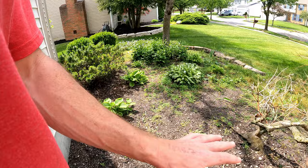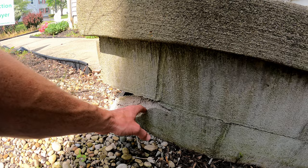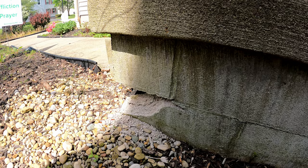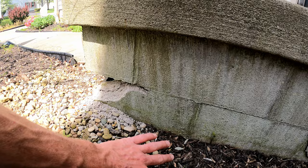This mortar masonry work here is really falling apart bad. There's a rodent in there, so we might recommend treating for that rodent. And then busting off all this loose masonry work and then patching over that with a concrete repair mortar. And do that strictly as a time and material thing, because once you start chipping into this and this thing goes and goes and goes, God only knows how bad that block is, how long it's bad for, and it may require a really intense structural repair.